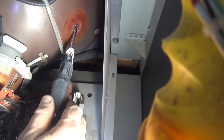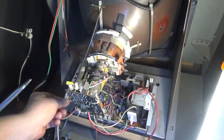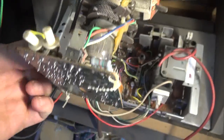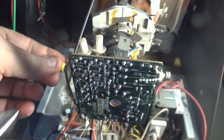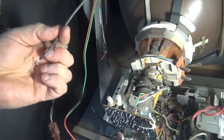If you feel a little uncomfortable, you can pop the cap off and stick this in here to make sure it's discharged. Now, the 4900s are supposed to automatically discharge — that's what this black wire is, and that's what the cutters are for. This black wire right here is normally completely solid and gets soldered. When we come across chassis that have never been removed, you have to cut the wire, then strip it and wire-tie it when you put it back in. So the only wire you cut is the return black ground.